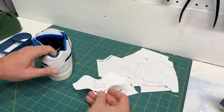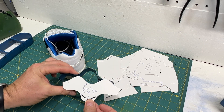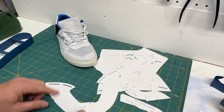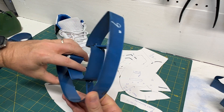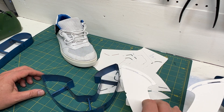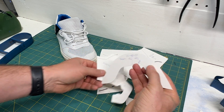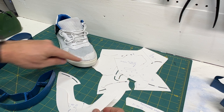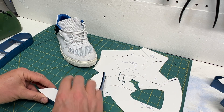Here is the mustache, or the backstay pattern. It looks like that — a goofy little cutting die. This is a symmetrical part, so you'd theoretically only need one. Here is the toe cap pattern part, and here's what the cutting die looks like for that. Because this piece is asymmetrical, you definitely are going to need a set of those that are left and right. The paper pattern shows the overlap mark, but the cutting die actually doesn't. Next, I just showed you the toe cap — this is the toe cap reinforcing material, which is undersized and fits inside the toe cap to make it stiffer. Here's the smaller cutting die — it's asymmetrical.